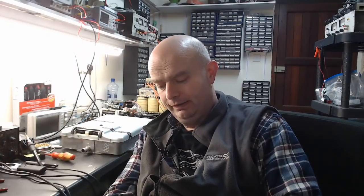Because I also decided that I should upgrade my little 2 kilowatt homemade capacitive charger that had served me well for 5 years and throw a Tesla Gen 2 charger in there. Not least of which was the potential for it to explode because of the 192 volt battery voltage that's in the E39, but also to give myself something more difficult to do, right? So anyway, yeah, you can get 11 kilowatts out of these chargers. So anyway, as I was saying, I decided to fit a Tesla charger.